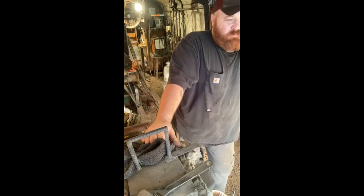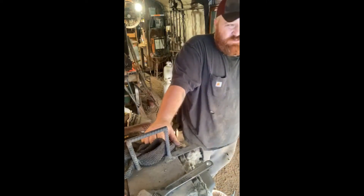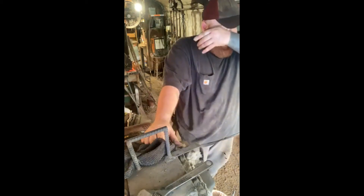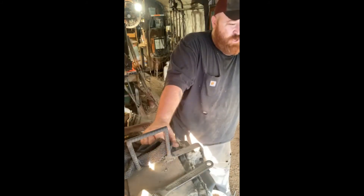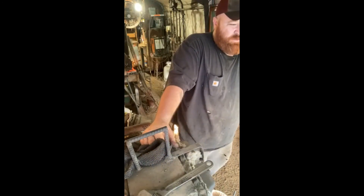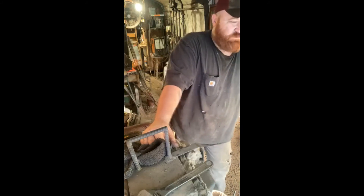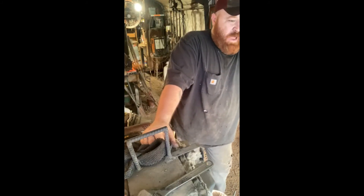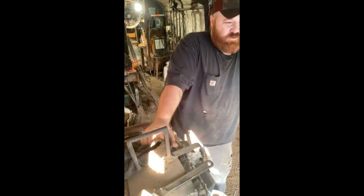You're using the can itself to keep oxygen away from your welds. I kept it in the vise, welded it up, immediately dunked it in oil, then immediately went to the forge to make sure everything was touching with no air gaps, because my welding is not the best. There are books on Damascus, but there's really no dedicated educational literature on forge welding in general — just little pieces and snips in blacksmithing books about how to do a scarf weld.